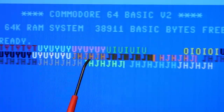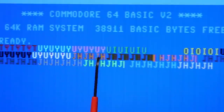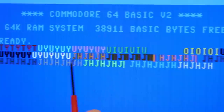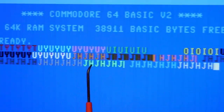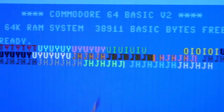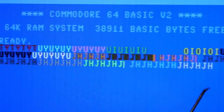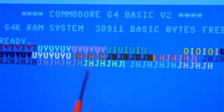Right off the bat, even though this signal is through S-Video, some of it is just not very clear. The J-H pattern displayed in brown color is very smeared and hard to read. There's also a little bit of color fringing around the white text and the green text. There are also what are called jail bars in this video signal — vertical lines that run the entire length of the picture. Overall, everything is just rather soft, far softer than S-Video has a right to be.